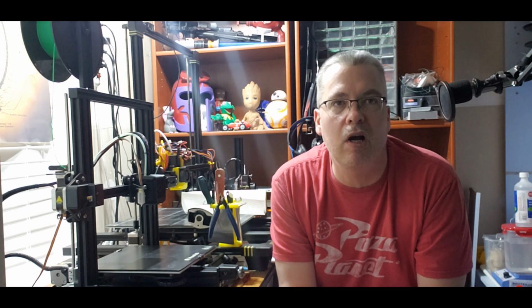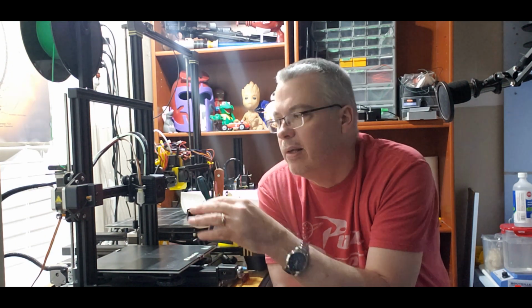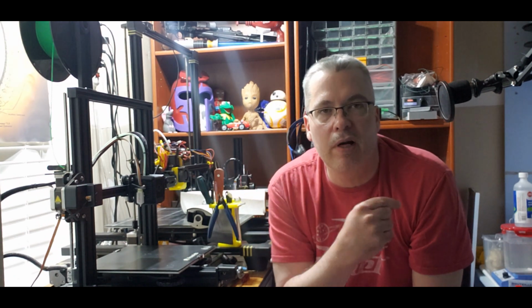So I did manage to get BLtouch working with the Aquila stock firmware, but I did run into several problems along the way. The first one was I noticed that the Z offset wasn't working. I would go down to -2, -3, -4, -5, and so on, and it still wasn't bringing the Z down. So that's what I did in Pronterface.